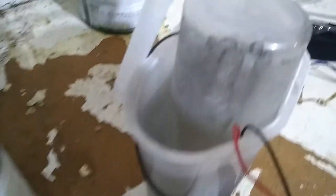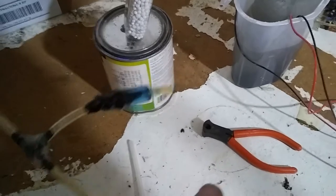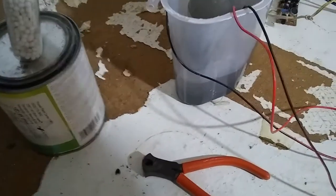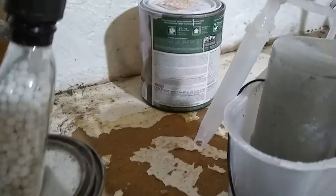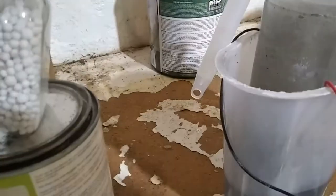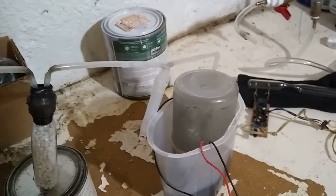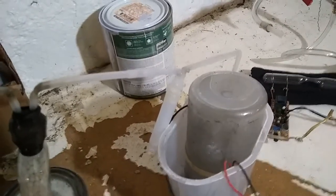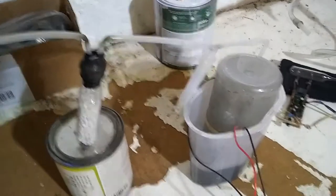Notice the sudden change in pitch? I just accidentally pulled some of the liquid through the apparatus into the suck-back trap — that's what it's for. The sudden change in pitch as I was pumping the air and then hydrogen out of there was the transition from air to hydrogen. It works about the same way as helium making your voice squeaky. In fact, hydrogen will make your voice squeaky.